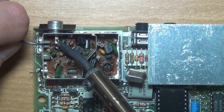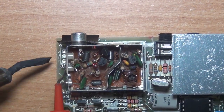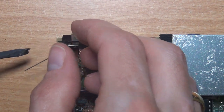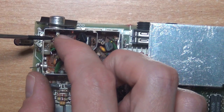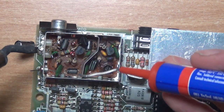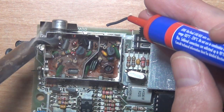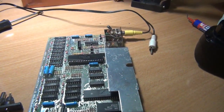Next we're going to add some fresh solder. We remove the power cable wire from the capacitor. We connect the plus side of the capacitor to the video signal, and the minus to the connector. Just a bit of solder and we're done. So let's connect a composite cable, which is also connected to my monitor, and let's turn on the ZX.